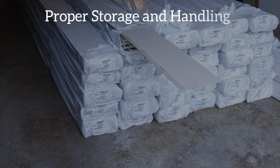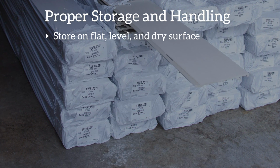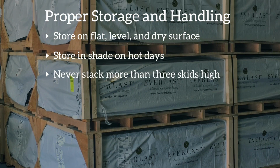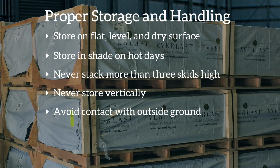Everlast siding should be stored on a flat, dry, and level surface to ensure the material stays free from foreign objects. On hot days, Everlast siding should be stored in the shade and away from any unnecessary heat sources. Keeping Everlast cool rather than hot during the installation process will help to eliminate any unusual lateral movement that would have been a result of excessive heat buildup. Never stack Everlast siding more than 3 skids high, and never store Everlast siding vertically. When stored outside, lay the bundles on supports to avoid direct contact with the ground.